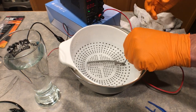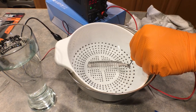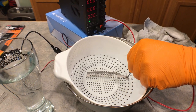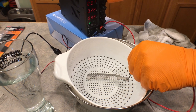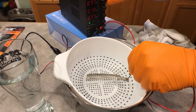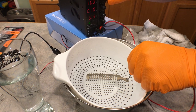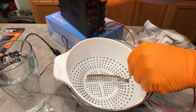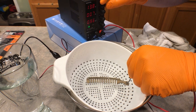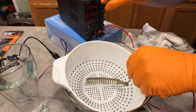I'm dipping it down into the electrolytic solution. We should start to see some color at around 10 volts or maybe a little less. Once we get to our dark bronze color that we want, I'm just going to go ahead and turn the voltage down. That looks pretty good.